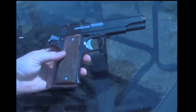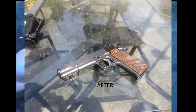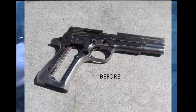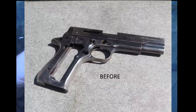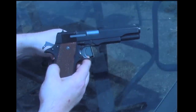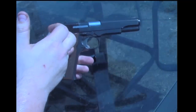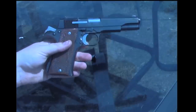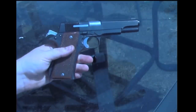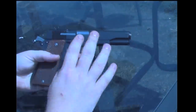If you want to try this at home, here are the steps: soak it in degreaser to get all the grease off, then dunk it in half vinegar, half water — essentially a gun douche — to get the bluing off. Then do your metal prep: I just hit it with a little sandpaper and polished the small pieces with a Dremel. Then blue it — it took me closer to an hour to an hour and a half in the bluing solution. I think the heat was a bit low. Then quench it in water to get the salt out. Make sure any holes or tubes are cleared — I had salt solidify in a back-strap hole and had to drill it out.